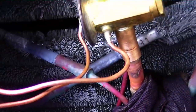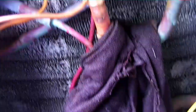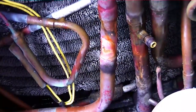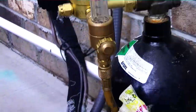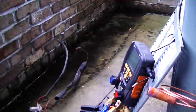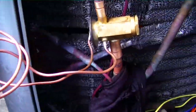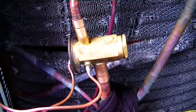We have our TXV all fitted up — kind of bending our copper out of the way. We'll flow our nitrogen, braze it up here, braze it up on the base, finish that up, then come down here and fit up the equalizing port into the suction line. We have our nitrogen set up over here with the flow meter. It's a pretty easy spot to work, a nice little enclosed area. I'm going to get to work brazing this up and catch you guys on the other side.